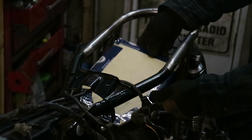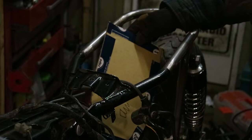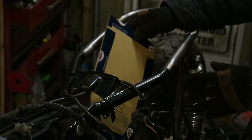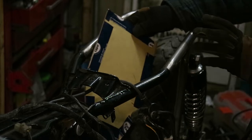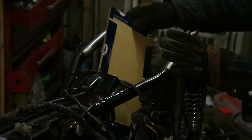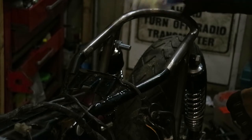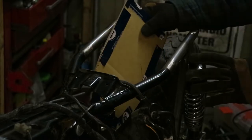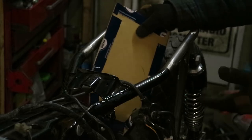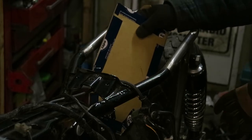The reason for the three inch drop is that I'm still unclear on battery choices. I'd love to go with one of the little thin guys — a two inch or one and a half inch box — but with the older 70s bikes, the jury's still out as far as I can tell about recharging and frying the battery. So I'm going to start by making a three inch deep box that'll be able to take any kind of battery. I'm still going to do a sealed battery on its side, but I don't want to be restricted, and three inches buys me that luxury.